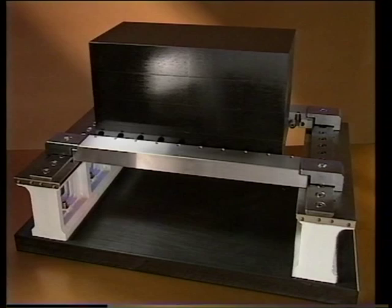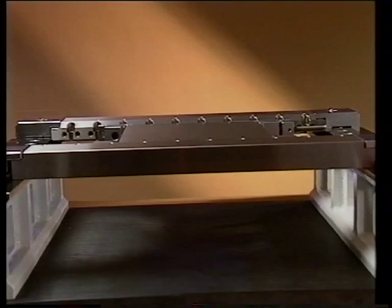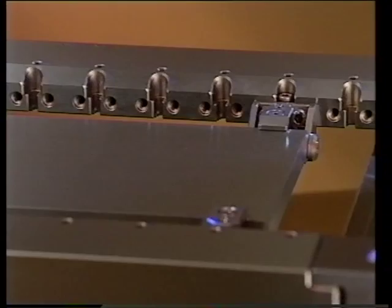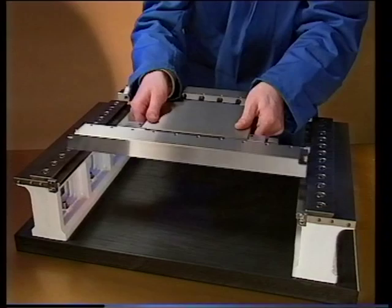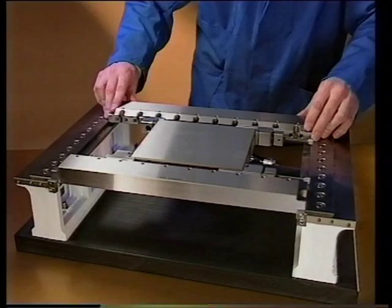The rulers have movable supports in order to reduce the risk of collision with the bottom arm and nozzles. The rulers can be fitted with different types of accessories: a super vise function for clamping rectangular workpieces without risk of collision, V-block for clamping round workpieces without risk of collision, and edge clamps for mounting thin workpieces. The workpiece can be mounted on the rulers outside the machine to reduce setup time in the machine with fixed references according to the conditions of the 1 minute setup.